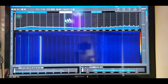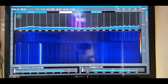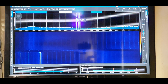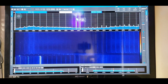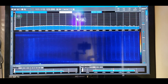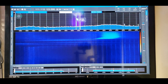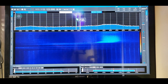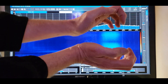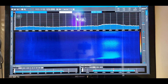Let's scroll over to 160 meters — our first ham band. Let's turn the capacitor and watch the screen. What you're looking for is a peak appearing in the noise floor — that tells you it's resonant. I'll turn the capacitor... see it move? There's a peak, but that's on the back side of the capacitor where the mesh plates are fully open and facing away from each other. That's not the peak we're looking for.